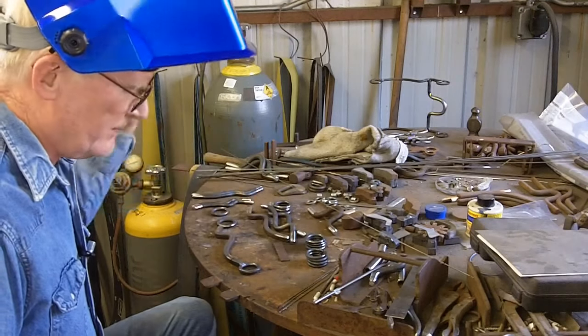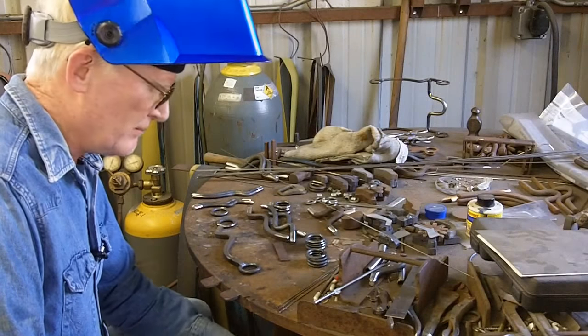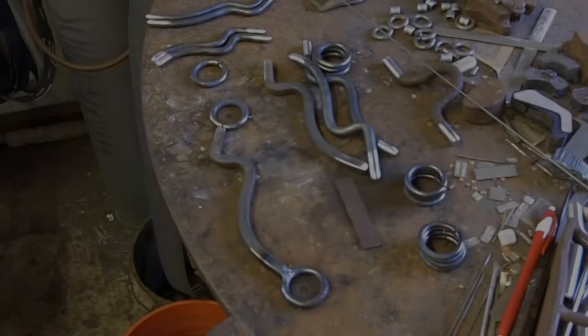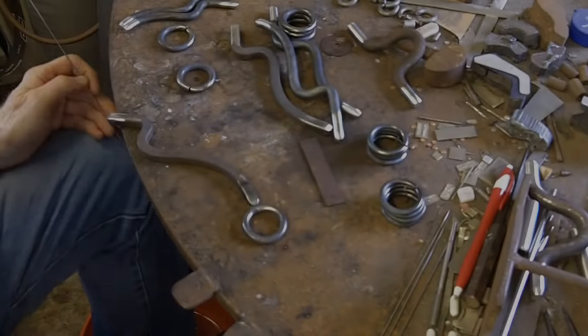Welding on this side develops a crust on the metal, so I'll wire brush that off with a 6-inch soft wire brush on the bench grinder. Here's a shot of the bead I just ran — that's the first bead. Hopefully each time you get a little better, a little smoother, and once you get going you can get a flow going.